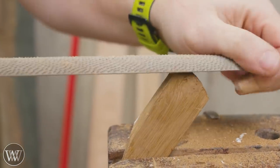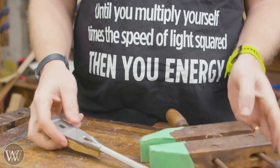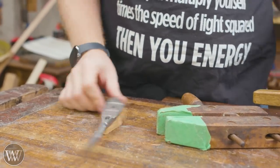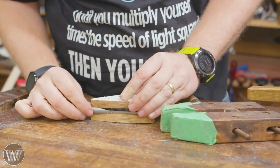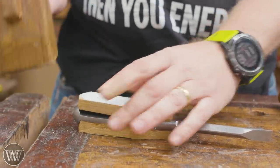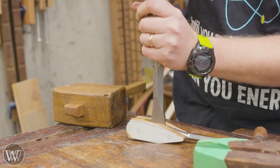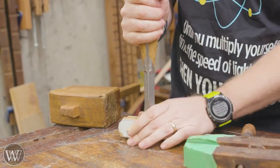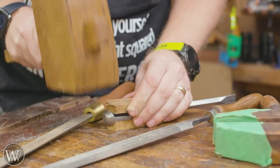I just prefer the solid knowledge of knowing that my holes are exactly where they need to be. So once we have that in shape, we can then come back through and drill the holes to fit into the first one. But while I'm waiting for the glue, I'm just doing the final detail on the other one. You can see how we're pounding it down in there and letting the screwdriver itself mark the sizes. When it gets too close to it, well, then we can use our other screwdriver to pull them apart. Yes, you need a screwdriver to make a screwdriver.